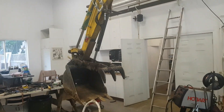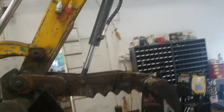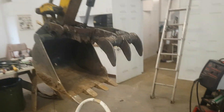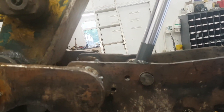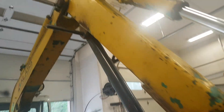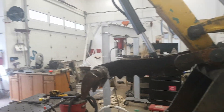Got the thumb built and it even works. Everything clears, good capacity, good reach. Haven't set the hydraulic relief pressures yet. The valves up there isolate the flow so I can use the twist wrist, and for regular use I've got the thumb. Need to add gussets between the teeth - they're fairly long. Still need to make permanent pins; these are temporary for testing. A little more welding and grinding but more or less got this working.